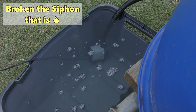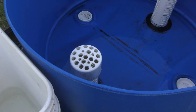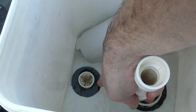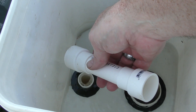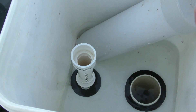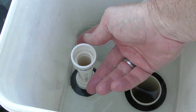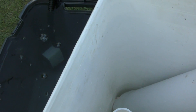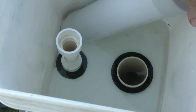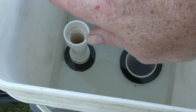There we go, the bell's broken. Just to show you, that tote is almost overflowing. What I had to do was make a nice short standpipe in there, because I just don't have enough volume to take all the water from the two-hole bed — so that's why this one's a little bit low. It's similar to the rest of my bell siphon designs. For the standpipe arrangement, I've got a one-inch uniseal in there with a one-inch section of pipe coming through, and I've got two 25-to-20mm, or one-to-three-quarter inch reducers on there — one so it can take the pipe going through the uniseal, and the other so it allows a greater volume of water to enter over the top to help initiate the siphon to begin with. This tote is just a little bit too small for the purpose I'm using it for, so that's why I don't have this standpipe at its full height — it could probably come up another 13 centimetres, or just over five inches.